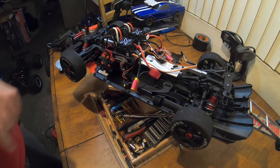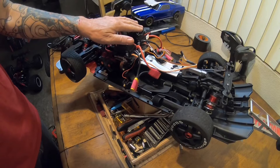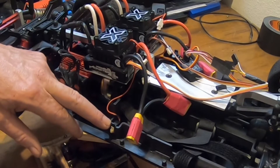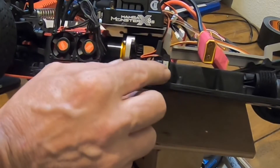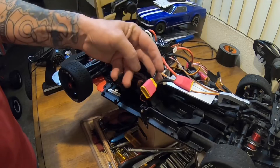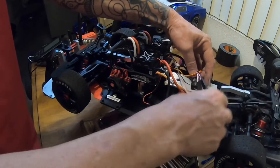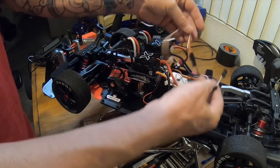Welcome back. Already did the video on installing the ESC. Today I cut slots down in this groove — one on each side — for on/off switches for the ESC. I went ahead and made Y connectors on both sides. I'm waiting for batteries to charge. I have the receiver steering plugged in and the Y in for both ESCs.